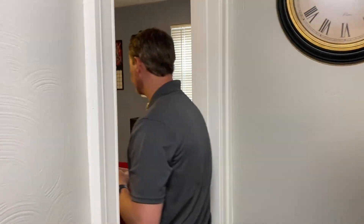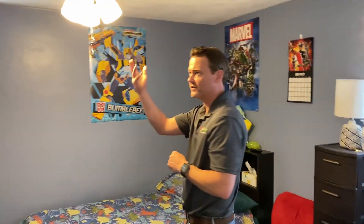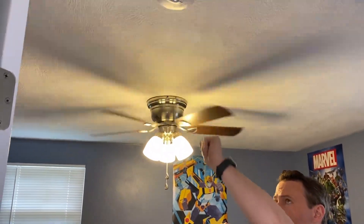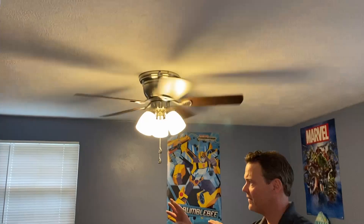Going into a bedroom — we've got a ceiling fan. This will have a junction box above it in the attic that's a penetration that needs to be sealed. There's a smoke alarm here that's also going to need to be sealed, and then obviously all the walls around us — the top plates and any wire holes that come up through them — also need to be sealed. Next we're going to create a map of everything.